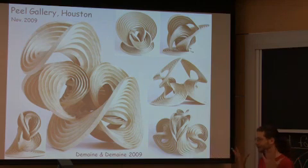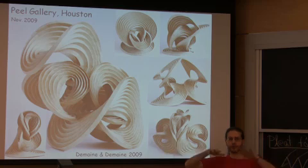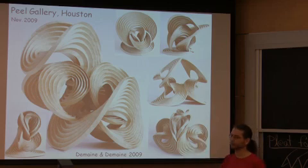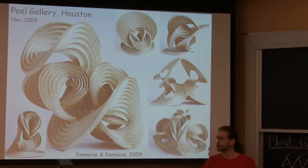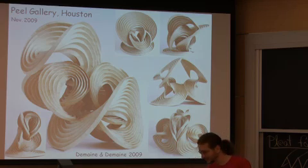So the powerful scientific engineering idea here is that you could deploy complicated 3D structures just by manufacturing very simple flat structures, maybe joining a few points together, and then just say go. If you can manufacture these things so that every crease locally wants to bend, then you'll get these 3D forms automatically. It's especially powerful at the nanoscale, where you can't have your fingers moving around and pressing things, but you can probably use materials that, say, when heated or when you add some chemical, cause everything to fold. It's very easy for us, from all the chip fabrication we do, to manufacture flat crease patterns, and that will let us manufacture 3D things at the nanoscale.